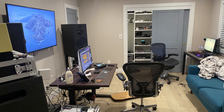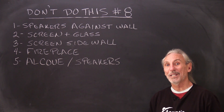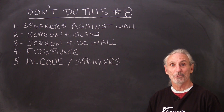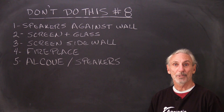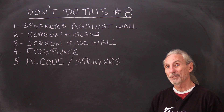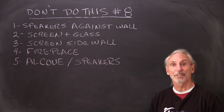We've got a big screen between the speakers, which is problematic, but that's the way it goes today in these mixing environments, especially ones that don't go to studios anymore and are setting up their rooms at home. The screen we can live with. Speakers against the wall we can't, because they produce audible distortions — that plus two, plus three, plus four dB bump from speaker boundary interference effect we just can't have, especially in a professional mixing room.